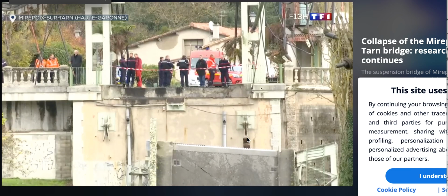And over here, it failed at the other connection, the other part of the connection, the bridge connection. That stayed and failed at this. I wouldn't say it failed at the pin connection. Yeah, it failed. I would like to see it. It pulled when the weight of it bent it out. Or did it pop? It probably caused it to buckle the pin, which is amazing that it didn't shear through.